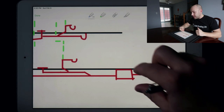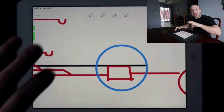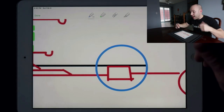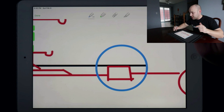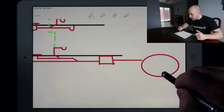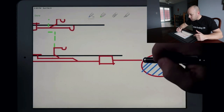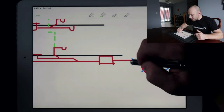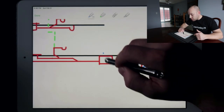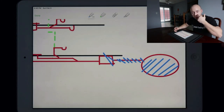And when the inspector came in, we had installed the backwater valve on the main, and the inspector asked us to take it out. And I think this is a really important conversation as to why, because it made a lot of sense once he explained it to us. So what happens is when the sewer gets overloaded, it starts to fill up with water. And once it starts to fill up with water, it starts coming back into the house. And this backwater valve will essentially stop the water from coming back into the house if it activates correctly.